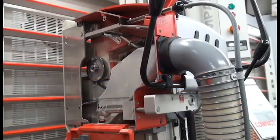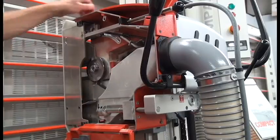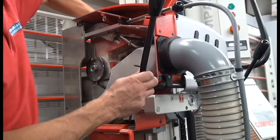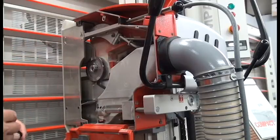This video is designed to illustrate the proper method of installing a Striebig scoring unit to an existing compact panel saw. First thing we need to do is open the saw door and remove the saw blade. The next thing we need to do is pull the riving knife back and onto its keeper back there to keep it back. We next need to remove the non-scoring shroud.